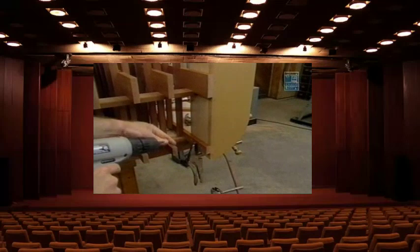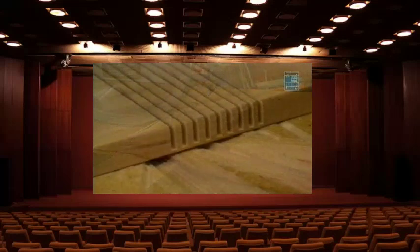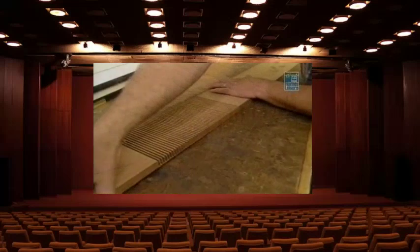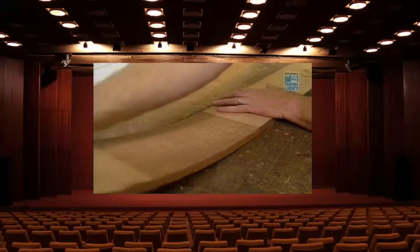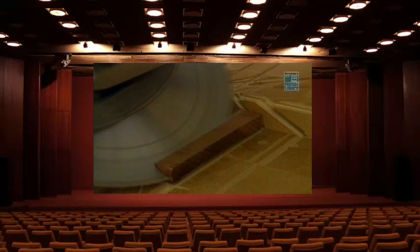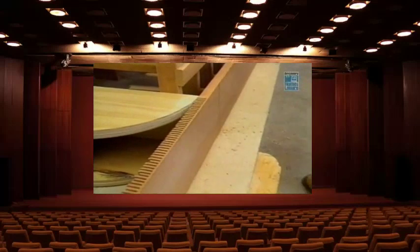Here I have a piece of one-by-six for the base, and the only way I'm going to be able to bend it around the plywood form is to make a series of kerf cuts almost all the way through the piece. Hopefully when we bend it very slowly it'll conform to the plywood and not break. With my radial arm saw tipped to 45 degrees I make a miter cut on each end of the base, and then secure the base just where the kerf meets the curve.